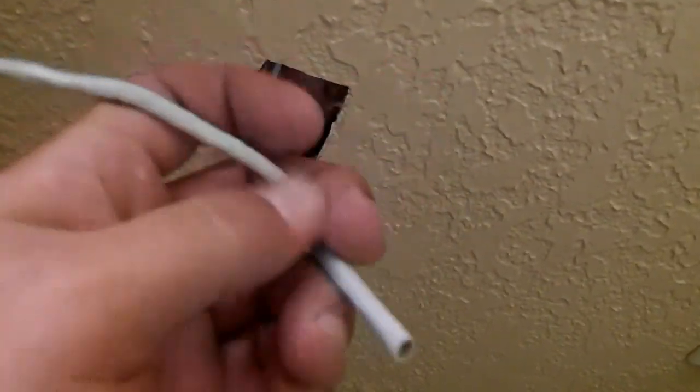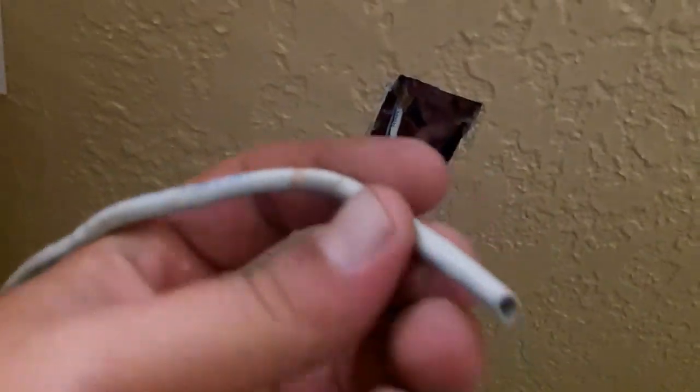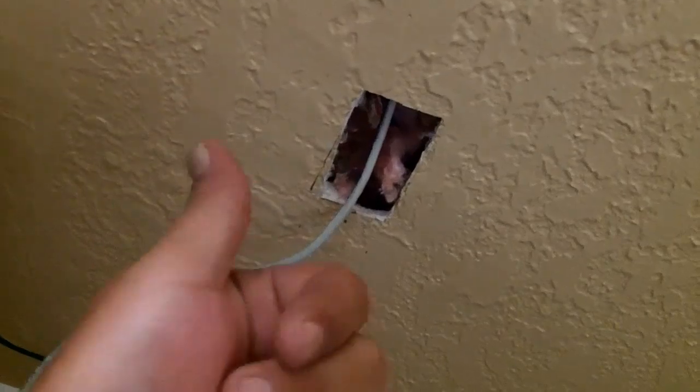I have this little length of copper wire — about a foot — so I can get back into whatever wall cavity I need and get that hook on the fish tape or the cable. Once you get that, you pull it through and cut the tape that you taped to your fish tape.